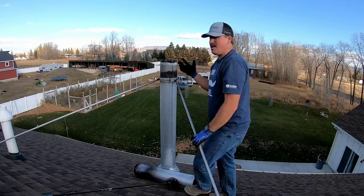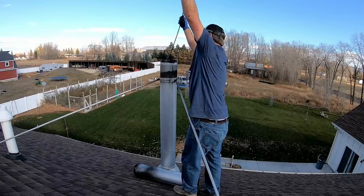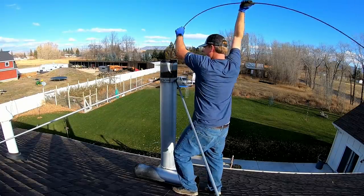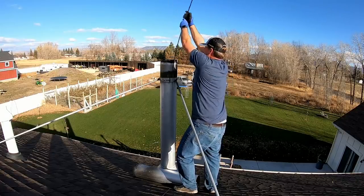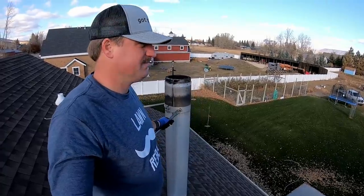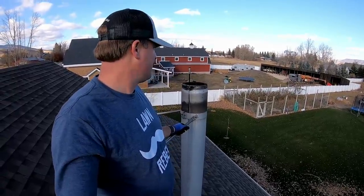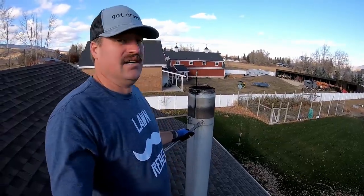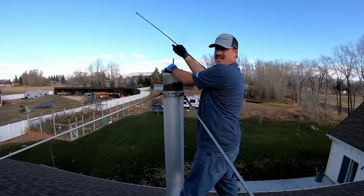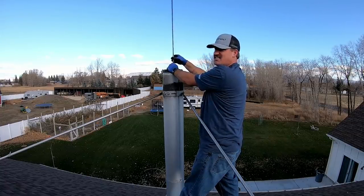The cleaner the chimney, the better the fire burns and the better the draft you get. It doesn't look too bad. All you do is stick the brush down in here and go like this — same thing I did out on the grass. I have no idea how much it would cost to have somebody do this, but I just don't see the reason to pay somebody. I could fall off the roof, and that wouldn't be worth the hundred dollars or whatever to have somebody come do it. But I'm fine doing it. I think I'm all the way down into the stove — I'm going to put one last rod on there. I think this is about 20 feet of stick.